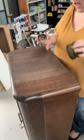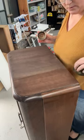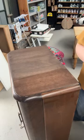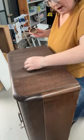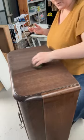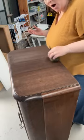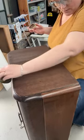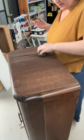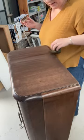Do you see how it's only a slight difference, but it's just enough to bring in a little bit of red? We're trying to get as close as we can to the original colour with what we've got. This is such a tiny, tiny drop. See how that's just warmed it up just a little bit and added that tiny touch of red? It's just enough to bring out those tones that were on the rest of the piece.